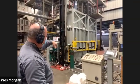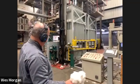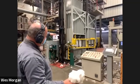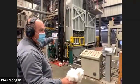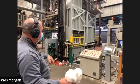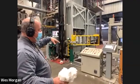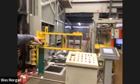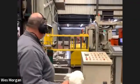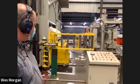There's 2 cylinders. It'll strip the box, actually pick the box up, and you'll be able to see the bale of cotton in there. It'll come down and press it down a few more inches to get it to just the right height. And this yellow strapper will go in and put 6 plastic straps on it. As soon as they're applied, the gate comes out of the way. There's a little cart on a set of railroad tracks that'll come across. When the bale gets done welding the straps, it'll kick it out onto the cart.